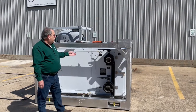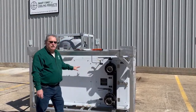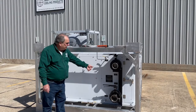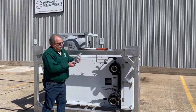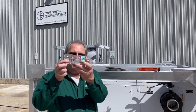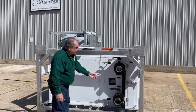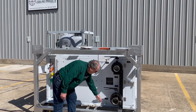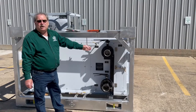To blow out the water, it's really simple. You want to set the equipment in a location so that all the water in the machine is being forced or driven towards you. I'll demonstrate with this water bottle — you can see how the water stands level, but if you tilt it, all the water goes to one side. It's the same principle inside the air handler. We slope the machine so that all the water in the coil comes to one side, where there's a header, a drain, an air vent, and the connections for the chilled water.